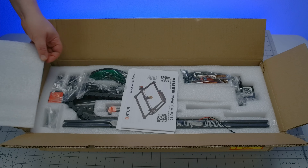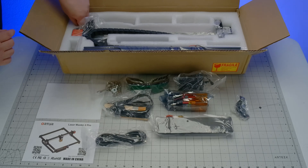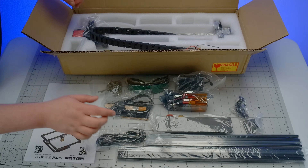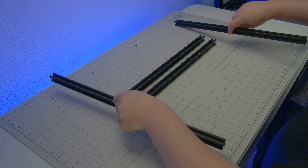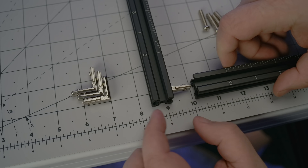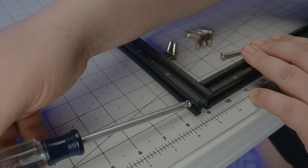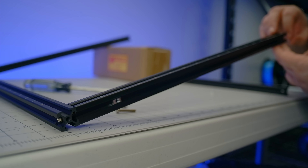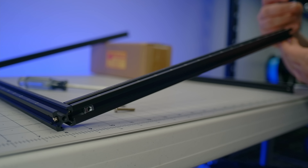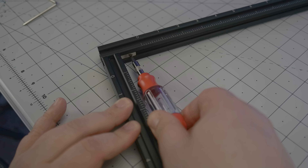We begin with a box, and looking in, it becomes immediately apparent that before we get to laser anything, we have somewhat of a kit to assemble. Four extruded aluminum beams make up the frame and are joined with a set of lock screw connectors. A single M5 screw pulls each corner into a proper right angle alignment, and then a couple of T-slotted nuts go into the outer channels for the X axis. Once the final beam is attached, we can tighten the lock screws.